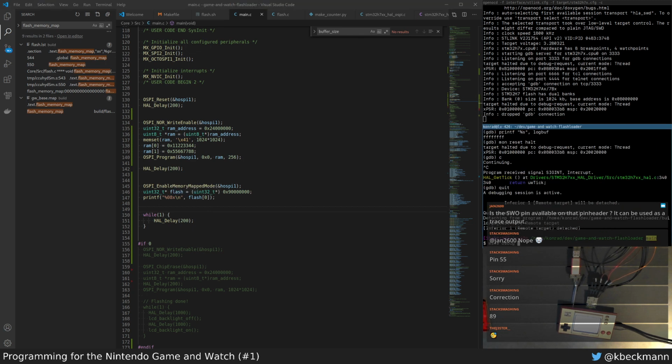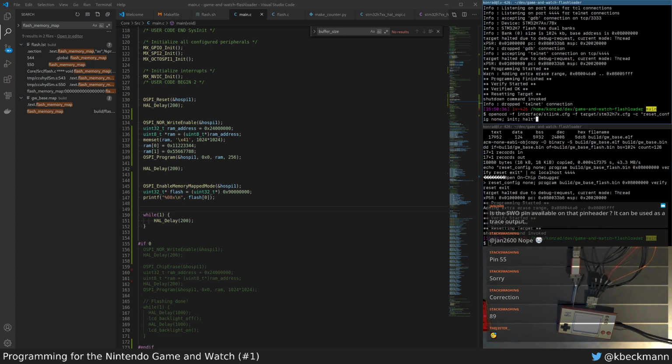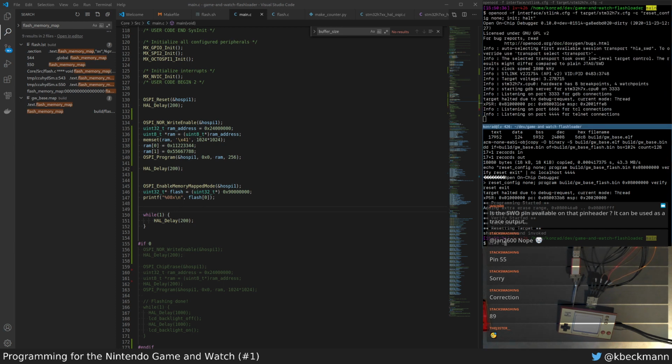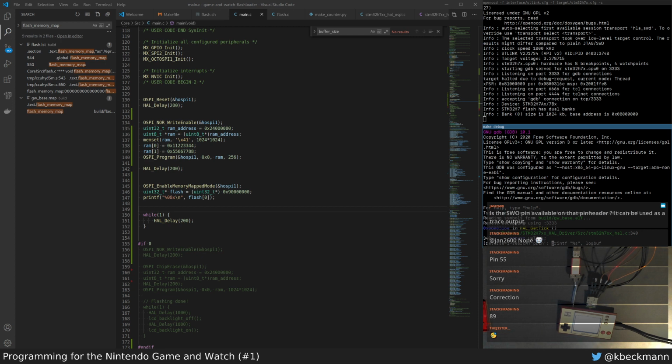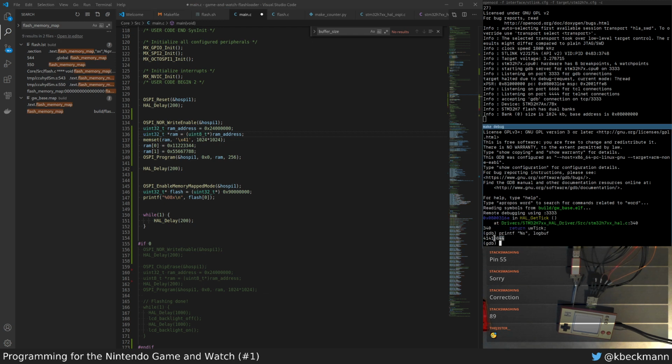So let's flash it. And then alt, debug, printf. Okay, this time it looks different. So it seems that we were actually successful in writing something, but this looks a little bit garbled. Right, I see the problem though. So maybe it's actually working because it takes one byte at a time, the LSB, the second one. Okay, maybe this is actually done. So now we have a single wire SPI mode for the big flash. Cool.